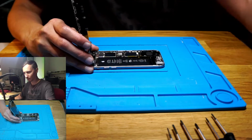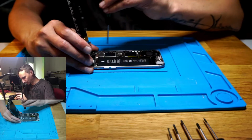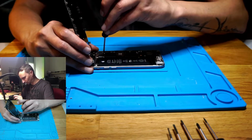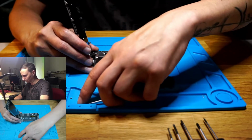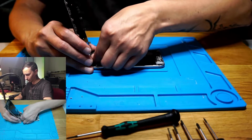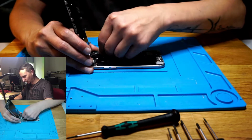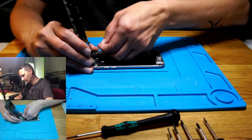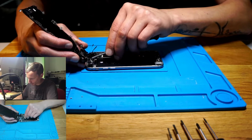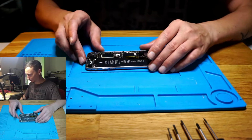So first we take off the screen. 4 screws, don't mix them up. Customer said phone was charging the last day in the morning fully, then it got very hot and turned off. Then it didn't charge anymore. I did try to charge it, it charges a little bit, but well, it's pulling amps, so charge won't hold because someone is eating our amps.